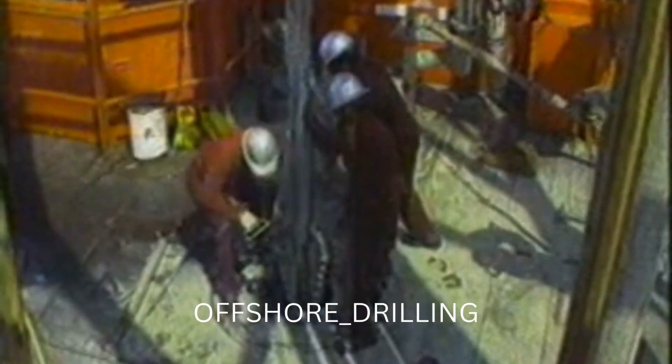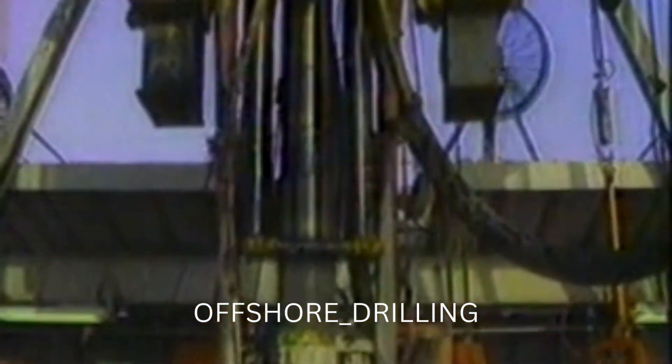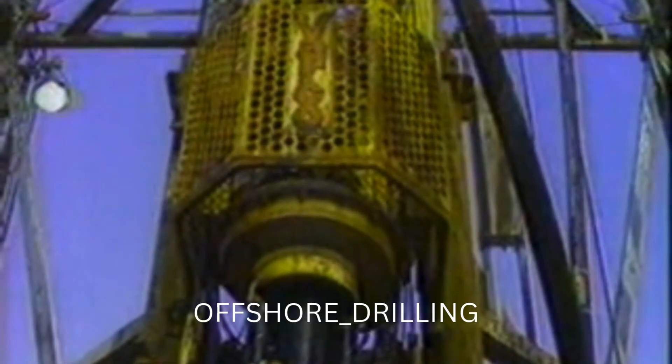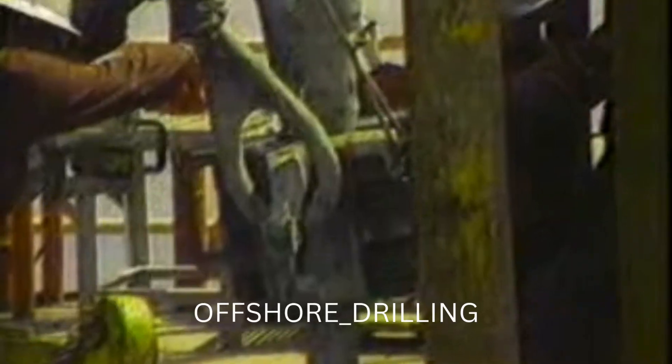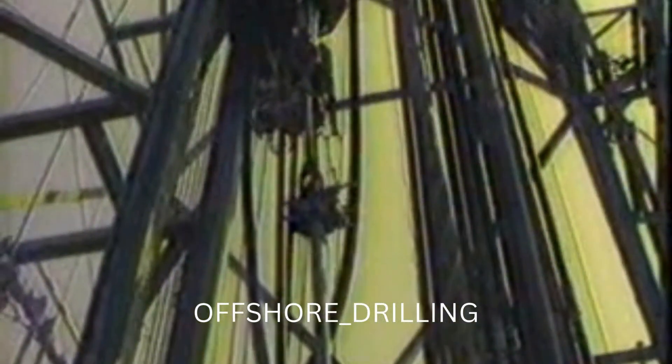When a turbo drill or a mud motor is used in a high angle hole, conventional drilling methods make it difficult to maintain a consistent weight on the bit. The power sub drilling system allows the driller to rotate the string while drilling with the mud motor to prevent wall sticking and maintain more accurate weight on the bit for more consistent penetration. A brake on the drilling motor allows directional drilling with a mud motor and a bent sub, and the ability to drill down 90-foot stands means fewer interruptions and loss of tool face orientation, for fewer surveys and considerable savings in drilling time. If single joints must be added to or removed from the string, a link tilt assembly lifts the elevators to the mouse hole to pick up or lay down the single. Drilling with stands is normally accomplished by picking up single joints in the mouse hole and assembling the needed stands prior to drilling. However, if additional footage is required, stands may be assembled while out of the hole, testing BOPs for example.